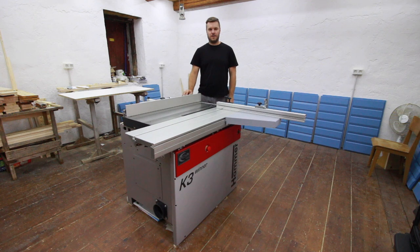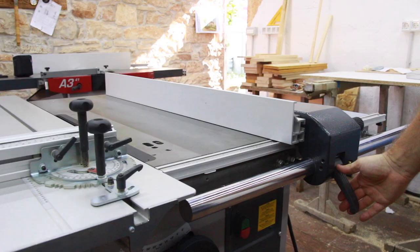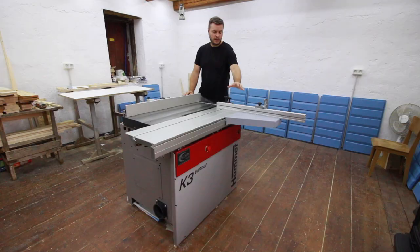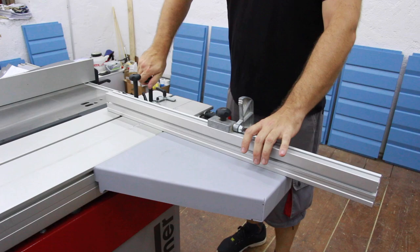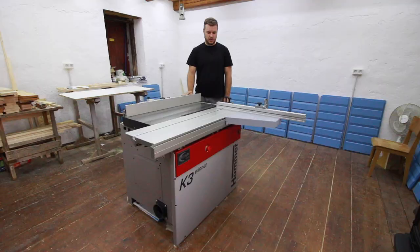Hi, my name is Andrea and in this video I will review the K3 Winner machine from Felder Group, specifically the Hammer brand, their most base model. Me and my brother bought this machine in January and we paid about €4,700 for it. In addition to the base model we also got the professional rip fence that is cast iron, the extension wing, and the miter cut fence with indexing pins for miters. It is a single phase machine that plugs into 220 volts and produces about 3 kilowatts of power.